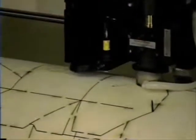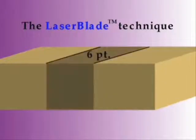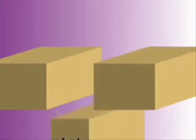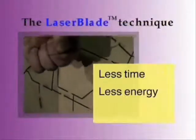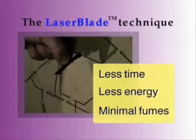To conserve energy and maximize cutting time, DTI's rotary laser system uses the laser blade or double-pass process for making four and six point cuts. Instead of cutting the entire six point curve, Data Technology's laser blade is focused to a narrow one point beam, about 0.014 inches in diameter. The beam then makes two highly accurate cuts on either side of the area to be removed, allowing a small rectangular slice four points in width to drop out. By making this double pass, a wide cut is achieved in a shorter time, using less power and causing minimal air pollution, having only two points width of wood burned for a six point cut.